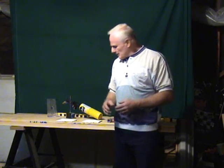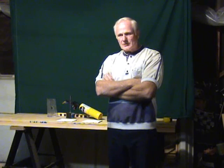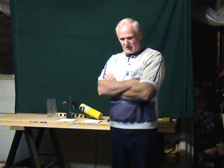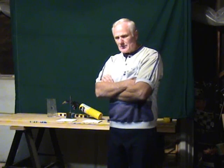Now the ASTM requires that you use a 6x6 panel of 1/4-inch plywood. Under ASTM E285, the flame test is a high heat test based on propane. Propane is approximately 3,300 degrees, and that can be looked up. We're using MAP gas here, methylated acetylene stabilized propadiene. It burns at 5,300 degrees. So we've decided to raise the bar on the heat because we want to do a 20-second test, and we want to find out what the transfer of heat is through this plywood as though it would be a person's home, whether it would combust or whether it would transfer heat.